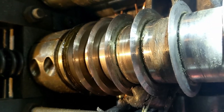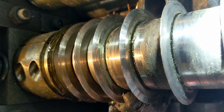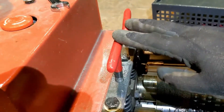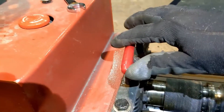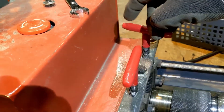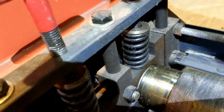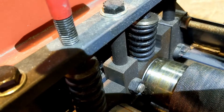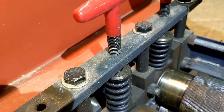The blades — I've been running a couple hours on bare bright on these blades and I don't think they're gonna last as long as I hoped. One of the problems I'm having is you run with as little pressure as you can, but these keep vibrating looser and looser. I don't know if I'm gonna put some tape on them or something — they'll sit there and just vibrate out as you're running and screw up your set.